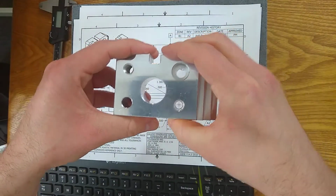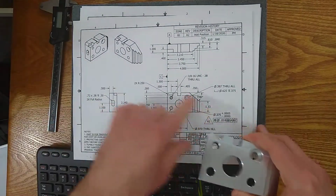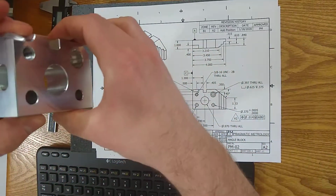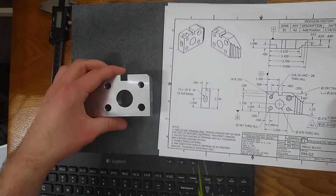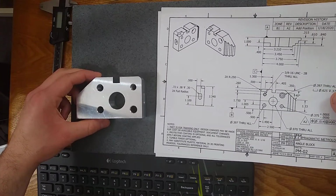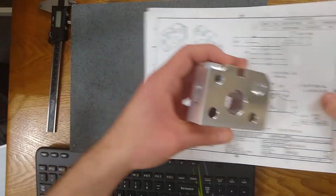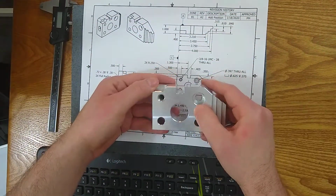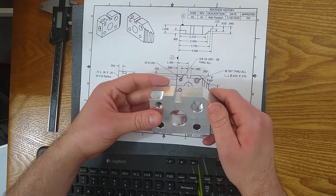Sometimes you have to go a couple of rotations because there'll be more views as you go, from left to right. There could be a back view, which isn't shown on this print. So in that case, you'll go one rotation, two rotations, and you would see the back. And if you're checking out this camera, you'll see what could potentially be another view. So remember, just practice that technique with this part here, the fishbowl swinging back and forth. It's a great quick check that either the part was made correctly or you're interpreting things correctly.